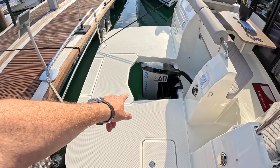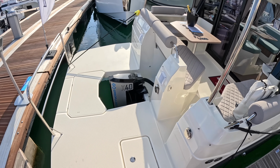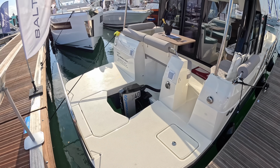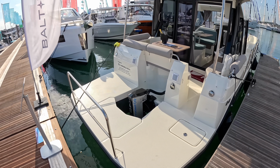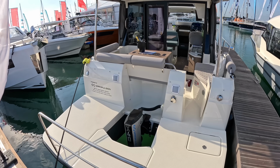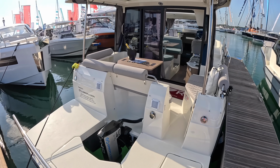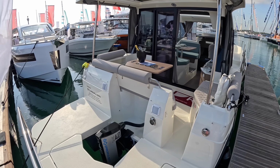That one there is a lift-up section, so you can tilt the motor or the outboard engine if you have it. And just while we're talking about motors, I will mention the range. Obviously, that's quite important. This one's running 400 amp, 96 volt lithium iron phosphate batteries, and that's giving it, at 4 knots, which is about 5 miles an hour, which is a very typical river speed, about 16 hours of running time. So it's giving about 80 miles, but typically for most people, that's probably about 3 days of running.